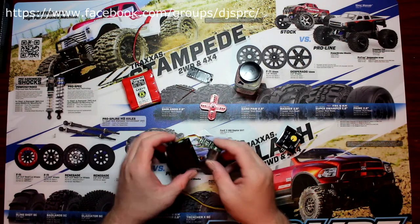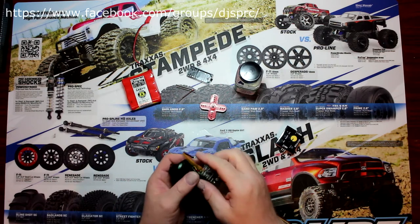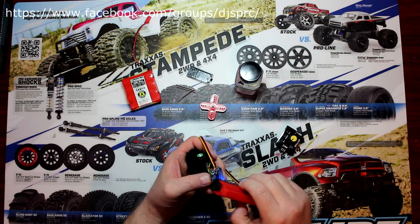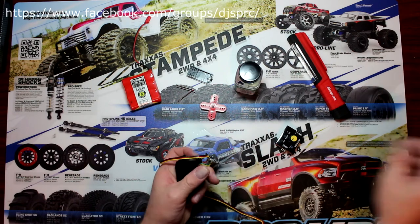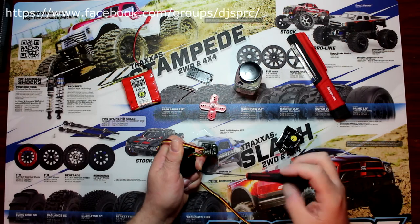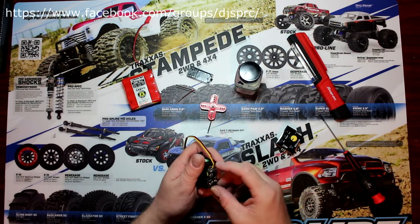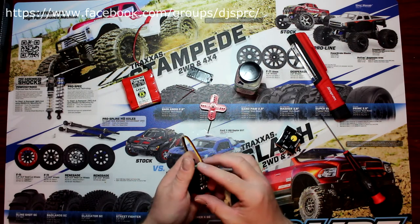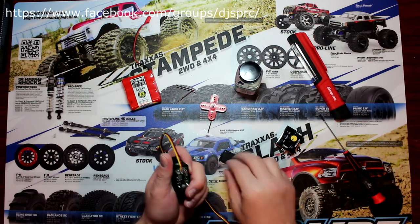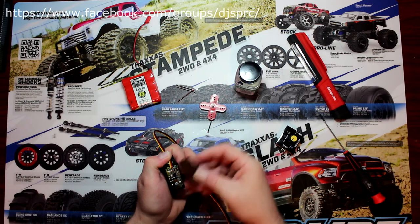And we're back. The product is fully cured. Now the only thing we need to do is reassemble the servo. I also grabbed my black light and went around to make sure I covered it everywhere — and I did, on both sides. Now we're going to remove the extra screw we added to keep our top on. It looks like this went well — did not need to remove the top. The other thing you could have done is grab the conformal coating and go around the seam here to reseal it — it will seal the case at the same time.